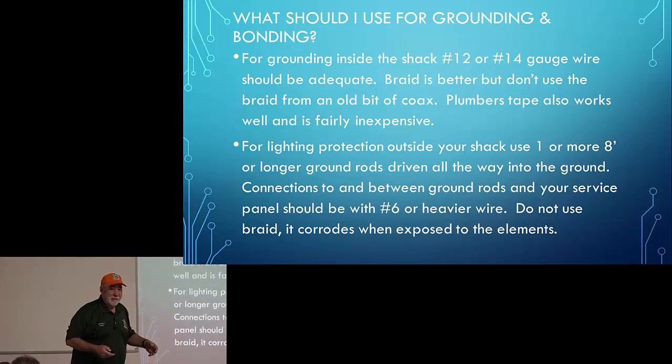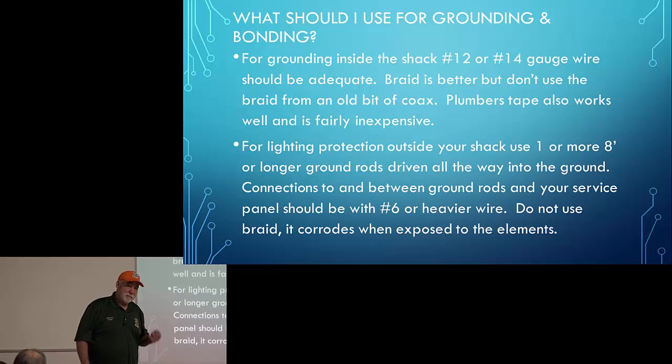Yes, sir. The other thing about mobile installations is that when you are dealing with different metals, and just because the door might seem like it's grounded out, you want the RF to flow on the surface and be continuous, just like you were talking about. Wherever there's a break, it's going to cause some kind of resistance. So when you're transmitting, you want the RF energy taking the path of least resistance instead of doing a corn maze trying to find its way.